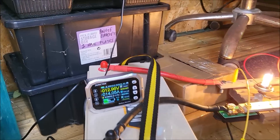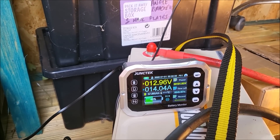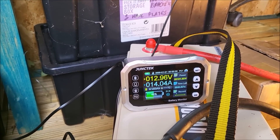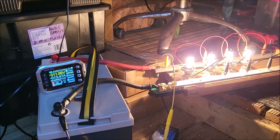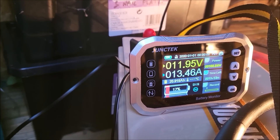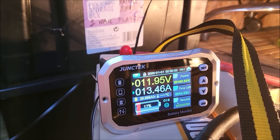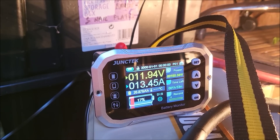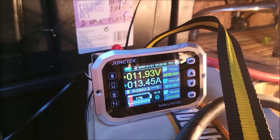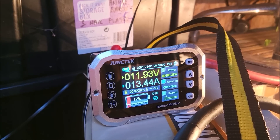Some hours later and we're down to 57 amp hours. I started the counter at 120 amp hours so it should reach down to about 20. The voltage is 12.96. This has been running for about seven hours now and the voltage is down to 11.95 volts, with 20.9 amp hours remaining. So we're pretty close to the full 100 amp hours, which is quite impressive considering this battery could do with some more balancing — it will naturally balance over time as it's charged and discharged.